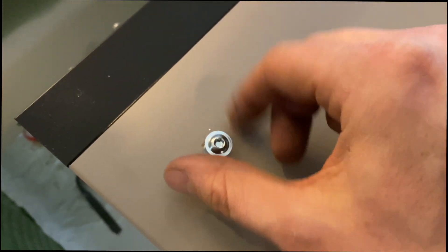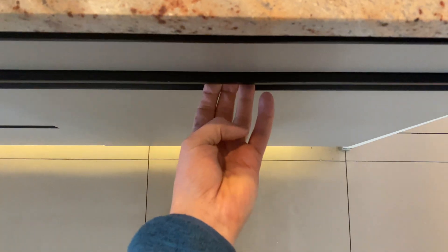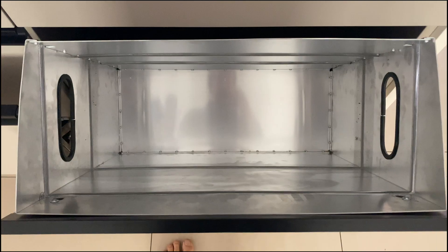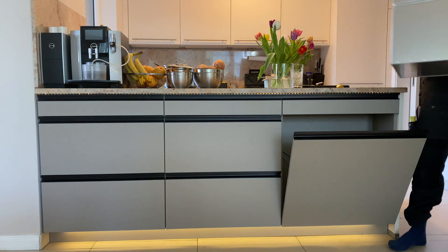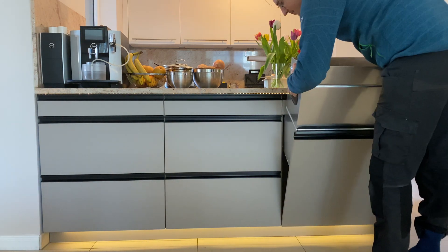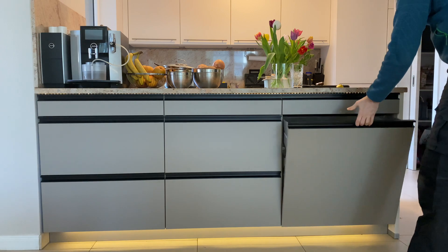The box is done and we can fit it to the front of the door - it almost didn't fit into the cabinet but it just about fits, so I'm really happy with that. I'm mounting it to the back of the door with a simple slot so you can put a screw in and hook it on, because it needs to be removable - this bin will fill up and I need to empty it easily. I hope this video inspired you to try out working with sheet metal. It's really easy, it's really fun, and you don't even need that many tools - a cordless drill and a jigsaw will work most of the time. Thanks for watching everybody, my name is Max Maker.